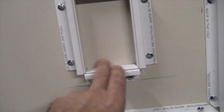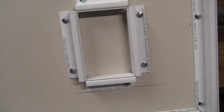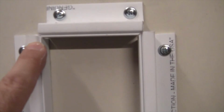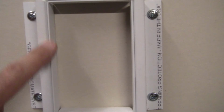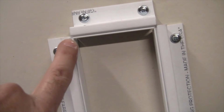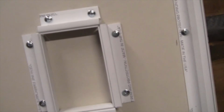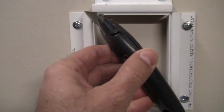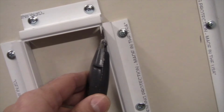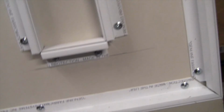And then the cutout box will go inside here. What else? Oh, on these cuts here, when I did this, what I did was I made the measurement. I added 1/8 of an inch, and then I cut off at a 45 degree with the utility knife, making this cut right here. These are all basically just cut 45 degrees, and I just did it with the utility knife, and that's how I made those.